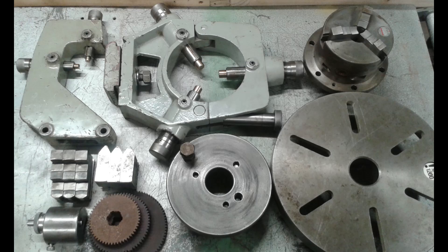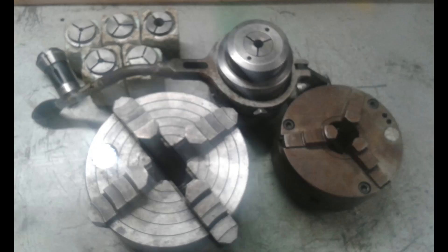This next picture shows some standard stuff: we've got a catch plate for turning between centers, the big face plate, the change gears for when we're changing different thread pitches when cutting threads, spur jaws for the chuck, and also a bed stop for when you're facing up to a face or turning up to a face. We've also got a fixed steady and a traveling steady — which if you watched the last video we didn't have, but I managed to source one.